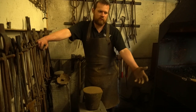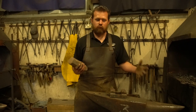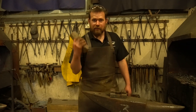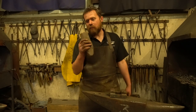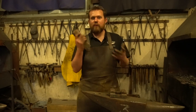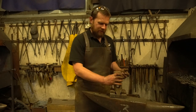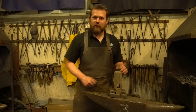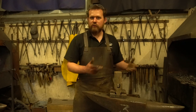If you haven't got the budget for a double bick anvil — around four pounds a pound — you can of course use any old bit of metal lying around. One of the first things I did when I was younger was go and pick up an old sledgehammer head, sink it into a log, warm up a bit of bar, and start hammering on top of it. It's got a hardened face and only a small body, but if you're only doing a little bit of tinkering to try it out, it's not a bad option.